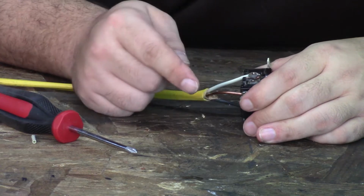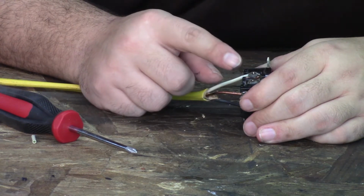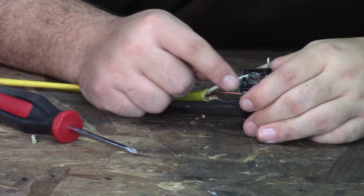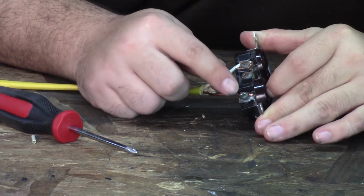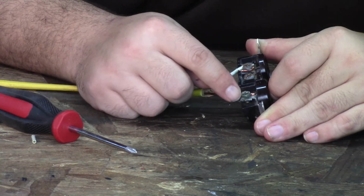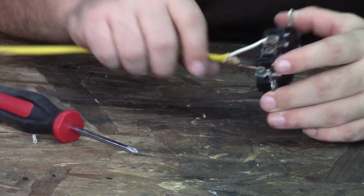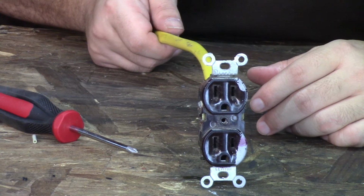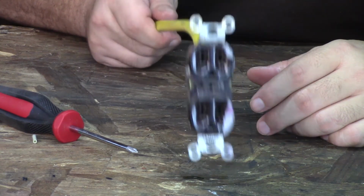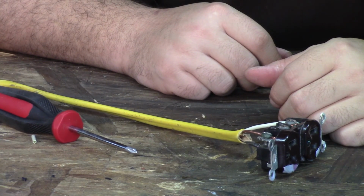This will work. This will carry a short out. If the outlet gets grounded out, it will bring it back to the box, but 100% this is the improper way to do this. So do not follow what I just did. Take the words, not the picture. But anyways, that is one wired outlet. So for a 98-cent outlet and 5 minutes worth of your time, you can save $200 by not having to call an electrician.